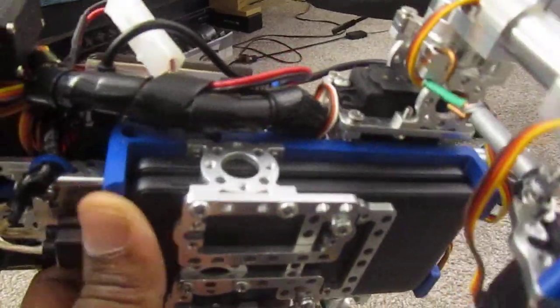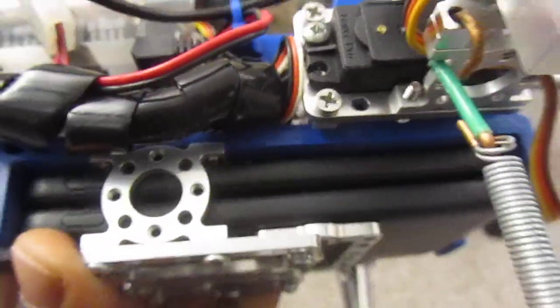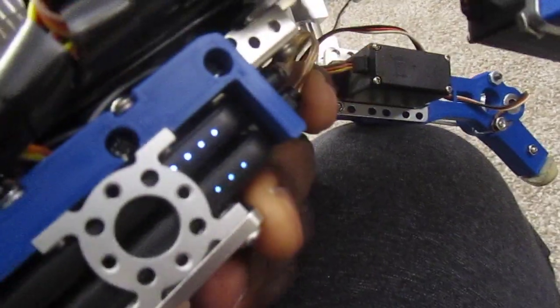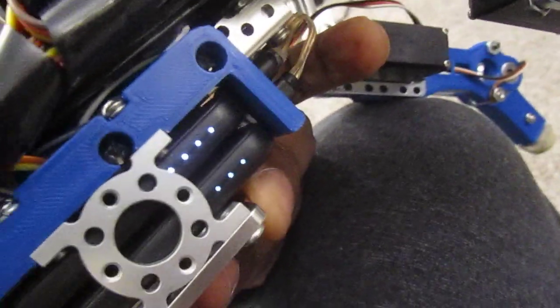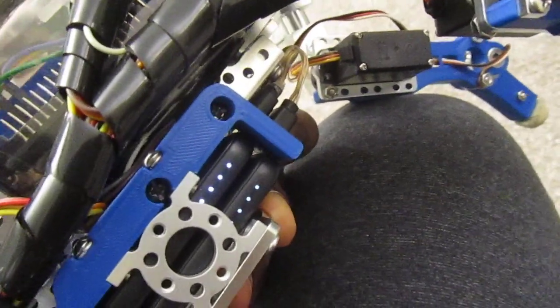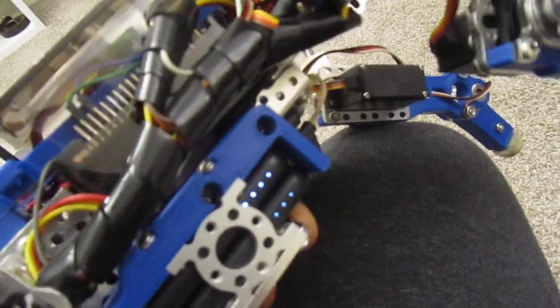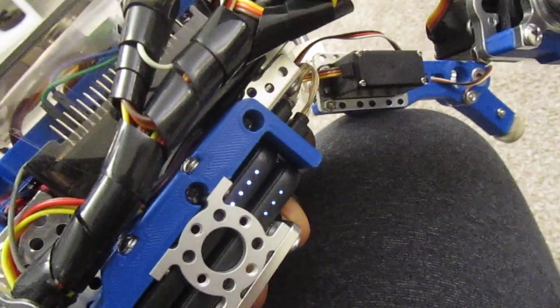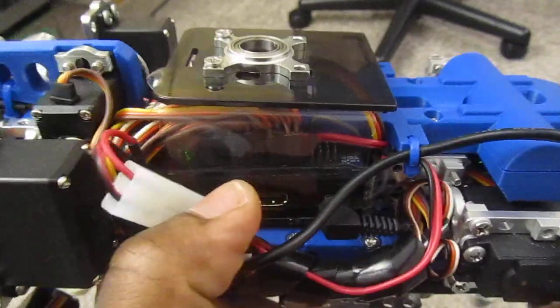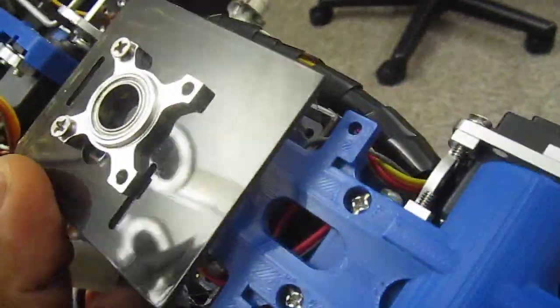Under it I made some little brackets that hold the batteries in place. I also updated the batteries — these are just 2-amp power banks, the same ones you use to charge your phones. So the whole thing runs on about 4 amps, which is pretty stingy with the power usage. That's why it doesn't move as fast as I'd like, and the processor is just a Raspberry Pi 3 which isn't very powerful, so I might upgrade that later to a Pi 4.